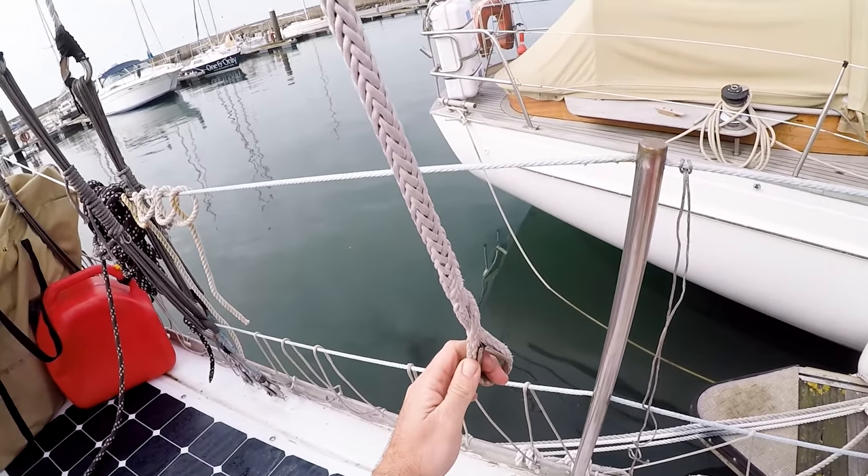I'm not against turnbuckles — if you have stainless steel you just have to inspect it. With a turnbuckle all you need to do is attach the eye to the turnbuckle and tension the bottle screw back to where it was. There's nothing fancy or complicated to it. With a dead eye it's fancy and it's complicated. Please pardon the mess — we're working on the boat and planning on sailing tomorrow. Right now I'm going to get the dead eye tensioned and all set.